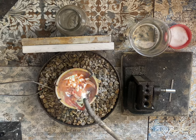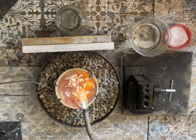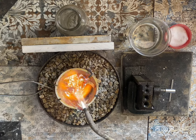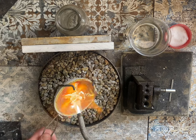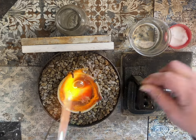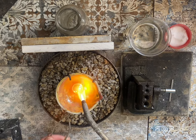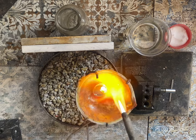While the silver is melting, I want to tell you something about slag. Slag is impurities and other materials that have separated from the silver during the melting process. Slag might be a result of non-silver items being melted with silver, or the silver simply having some impurities in it. Regardless of the reason, always skim and remove your slag before you pour and cast your silver. In this batch I didn't have any slag, so I was unable to show you that, but maybe in the future I can make a video on how to remove it.